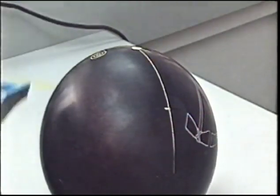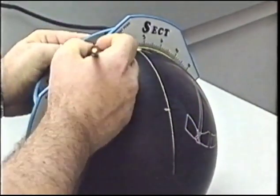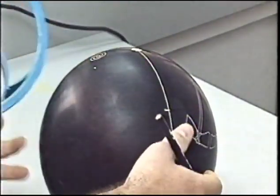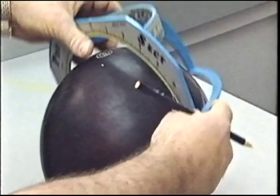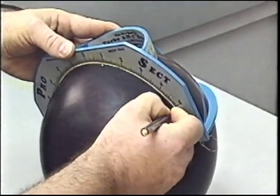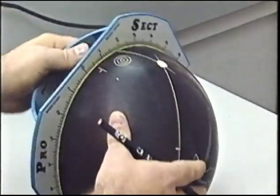Once again, we need to make this layout flare safe. We're going to draw a line 2.5 inches from the pin as a target. Reversing our axis coordinates, we're going to use the 5 inch. So we're going to measure back from the PAP through the target a distance of 5 inches for the center of our span.